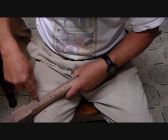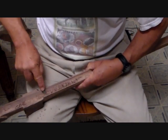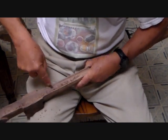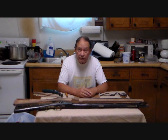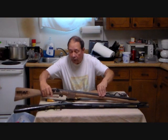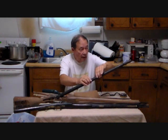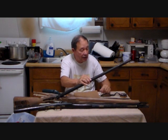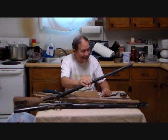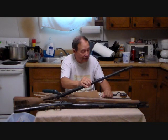So we take our time and go slow — yeah, this is tedious stuff, but we'll ultimately get it done. Now, we are proceeding with inletting the barrel for the Brunswick rifle, and we are now to the point where we are actually inletting the barrel lugs. You can see the three lugs here, as well as this one that I have actually cut off. This is where the attachment was for the front sling swivel, but it's actually too deep for this stock — it goes all the way down to the barrel channel. So I'm not doing that; I went ahead and removed it.